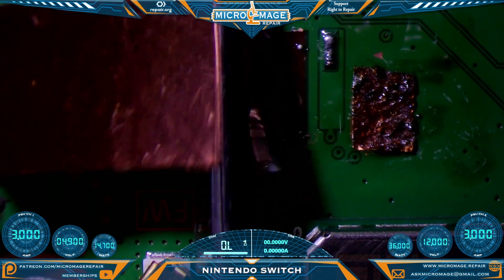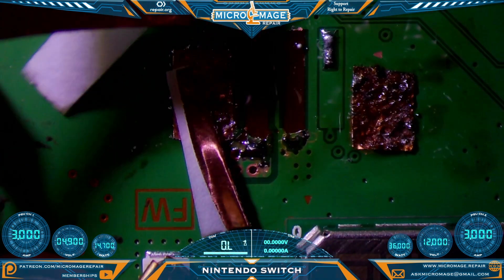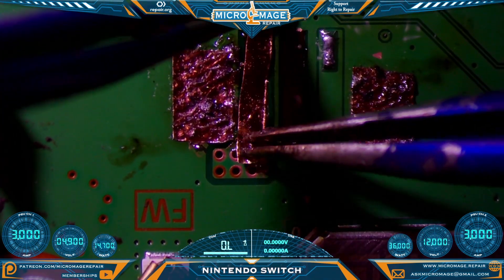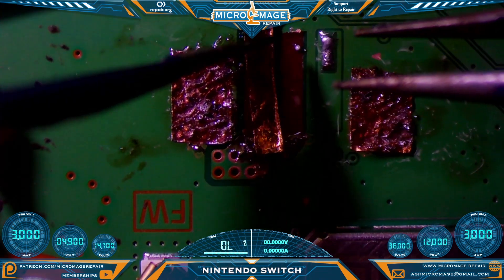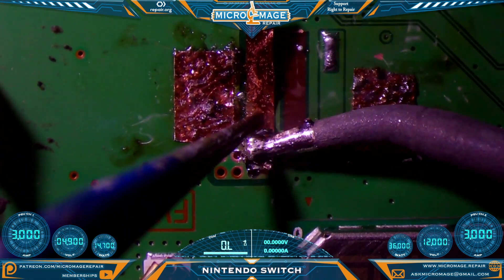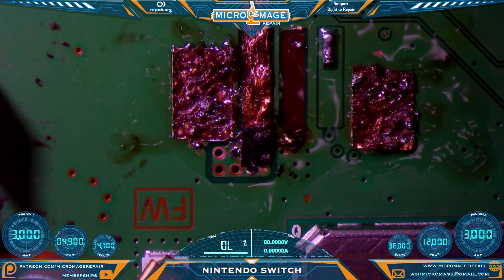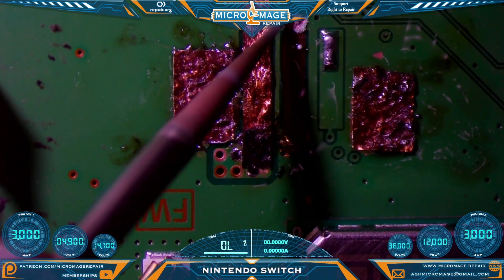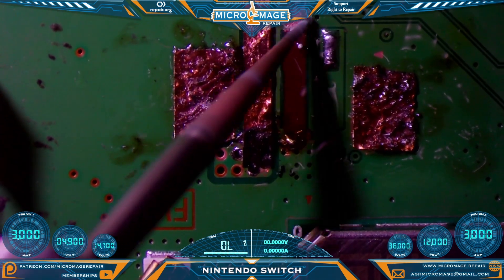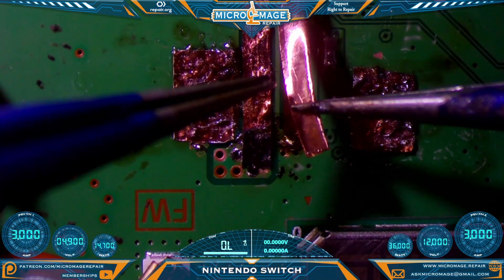I'll try an eye — pretty close. Make sure we're not going to be too wide; I don't really care about being long. I think that'll be perfect. Go ahead and pre-tin it, hold it down. That's pretty good. This one being ground, we can also do a little bit on this side and secure it down on two sides instead of just having it flopping. We'll secure this one down as well but we'll have to use conformal coating. Let's make sure it's not going to be too wide — I think it's going to be perfect.